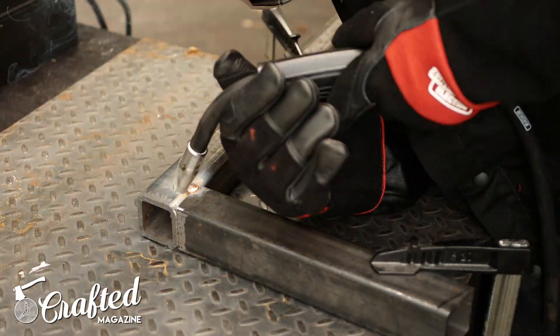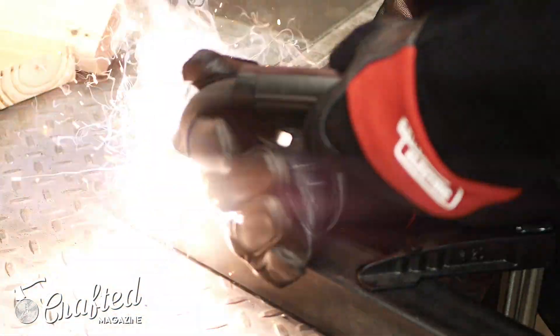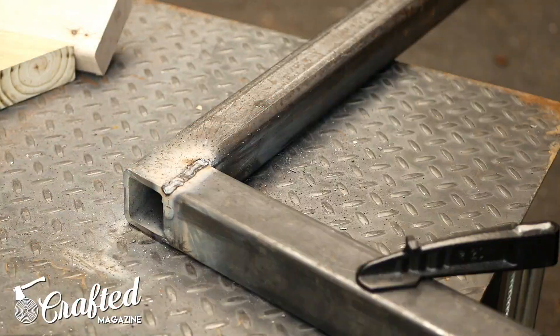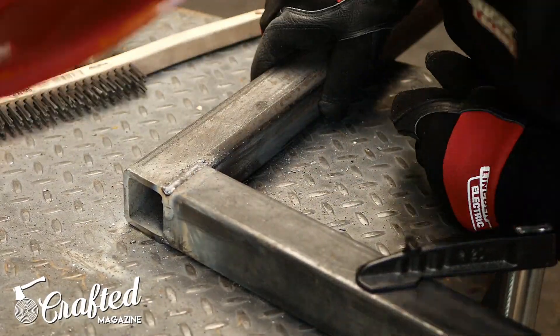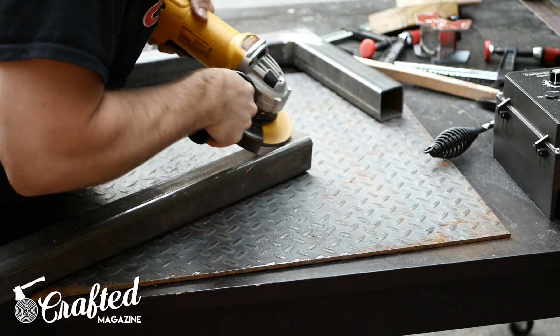I started the welds by making a few quick tack welds to hold the pieces together, removing the slag created by the flux core along the way. After tacking the pieces together, I ran beads on each side of the joints. On the second set of legs, I decided not to run a bead on the bottom of the legs, as three beads alone are incredibly strong — way stronger than I really need for this desk. Running beads on the bottom meant I had to grind them flush for the legs to sit nicely on the ground.